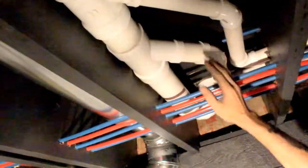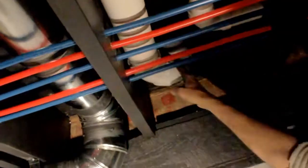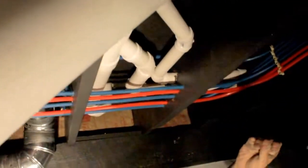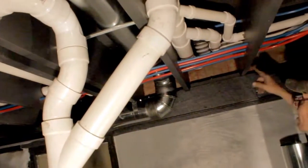This right here is that 2" that goes up. That 1.5" is tied into. This is my vent for my toilet. Okay, it's a dry vent. Some counties will allow you to do wet venting. This county won't. You have to dry vent, so that's why that's in there.